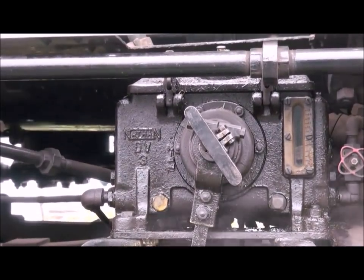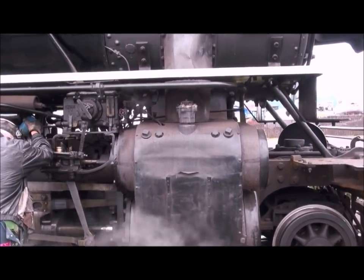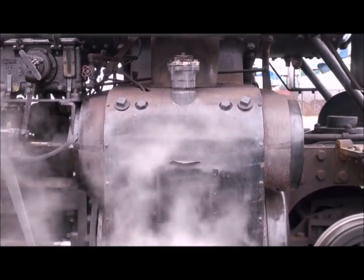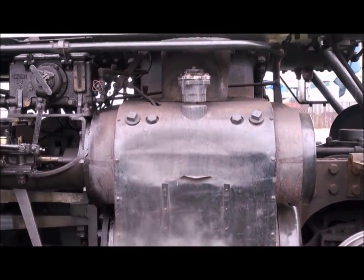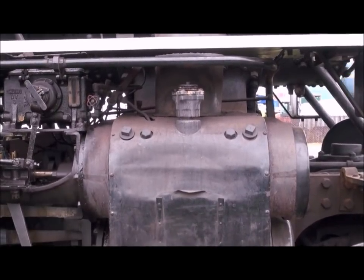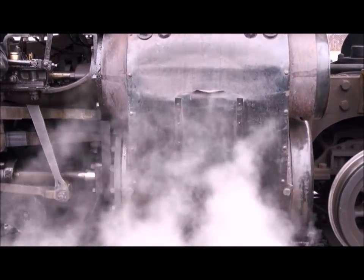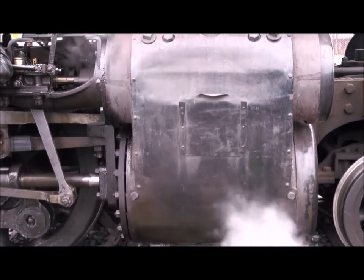On our locomotives we have four different kinds of oil, plus grease. So you're going to have to get to know what goes where. On the top part is the valve, and at the top of the valve there's a snifter that keeps it from back-suctioning. So the valve directs the piston which direction to go. It's quite interesting understanding the timing involved with getting a locomotive to work correctly. These are a bi-directional piston, which means the piston will have steam on both sides, alternating back and forth. That's what enables you to get four power strokes out of each rotation.